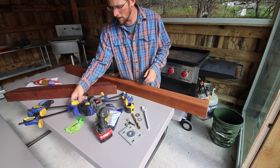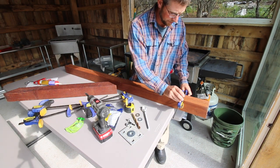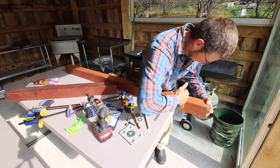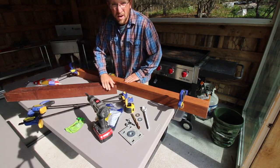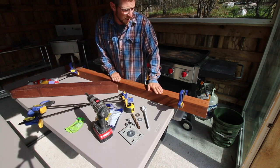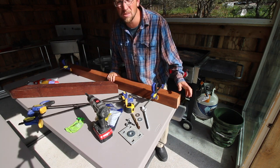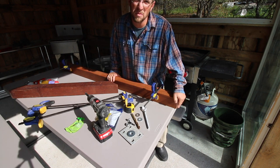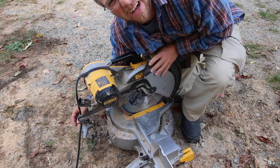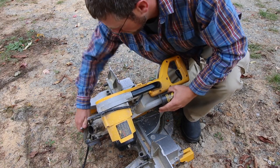We want to flush up the front and we're going to clamp it all together. We need to cut two 45-degree angles on our four-by-four post, which we've already done, and now we're just going to put a chamfer on the edge of our two-by-fours. It'll just clean it up and make the edge look a little bit more finished. It's not necessary, but it'll make the arm look a lot nicer and finish it off. Set our saw to a 45.